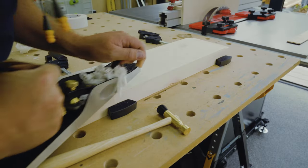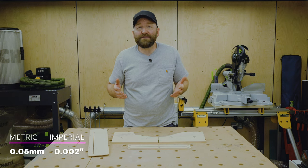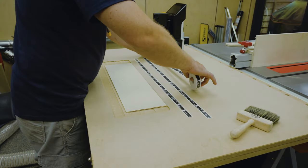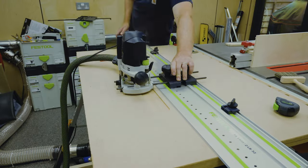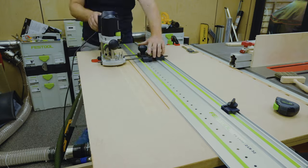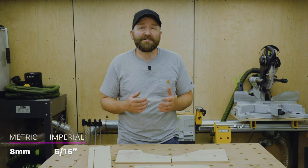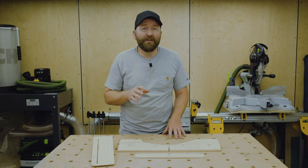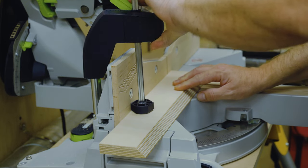I was able to use the jack plane to get my boards back to a tolerance I was happy with — maybe a couple of thousandths off dead flat. With the Shaper, I had read that you needed to get your board on the same plane as the Shaper Tape, however with my mitre saw parts I was between 5 and 8mm above the tape and had no issues. With the Kapex fence I think the optimum thickness is actually 8mm instead of the 10mm I used, as this will give you more clearance for the hold down clamp, although with the fence installed you can't rotate the hold down clamp into the optimum position.